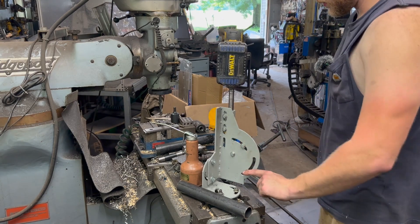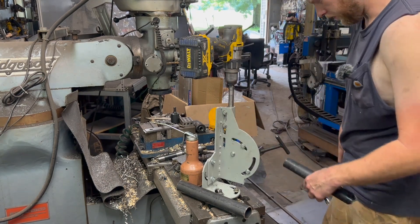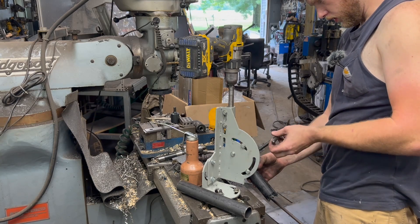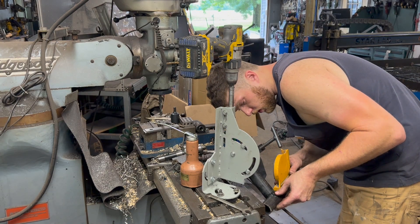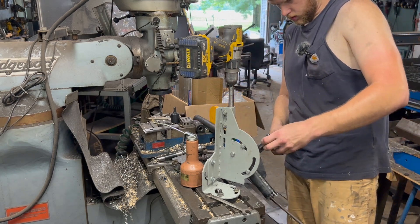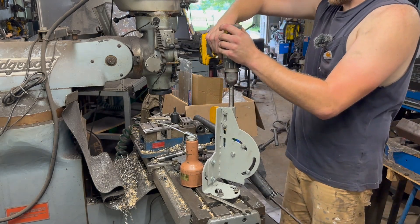Time flies when life's fun. I'm going to move this up and cut this off. Slice this off a little shorter — it's a little fit. Tube notcher. Hot. So it should be perpendicular to that. Check this — we're at zero degrees. Holy cow, we're exactly at zero. That never happens, especially when the cameras are on. Just like that — it'll break it.